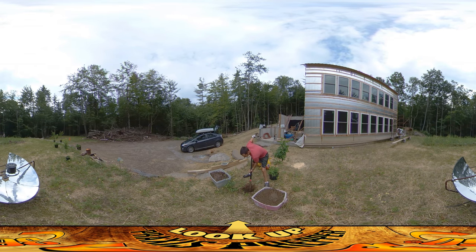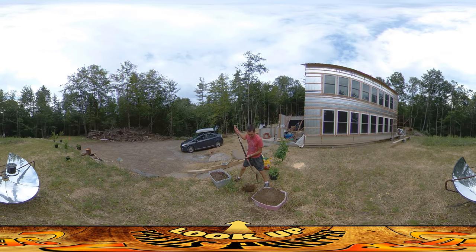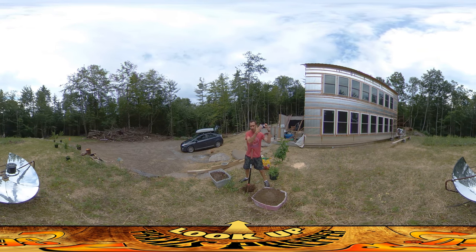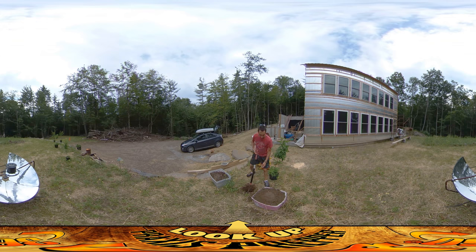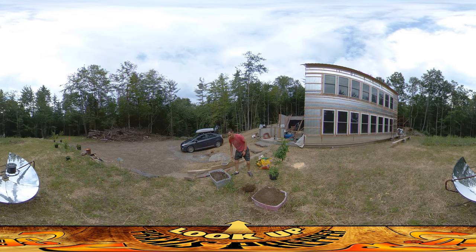I'm making a cavity that's bigger than the opening at the top. The dirt in here right now is some clean fill that was brought in — it's what they call sandy bank run, which is a mix of sand and the silty washings from rocks at the rock and gravel place. When they clean the rocks they wash the silt off and mix it with sand to create this material. I chose it because it's inexpensive, and it's not just sand where water goes straight through — the silt means it won't lose moisture super quickly.